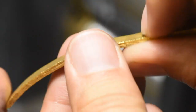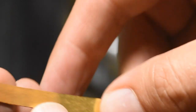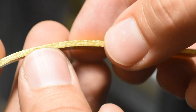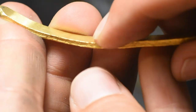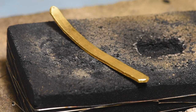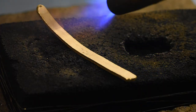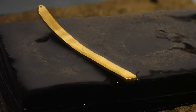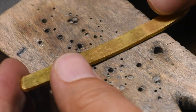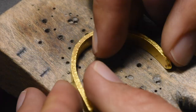You're going to ask how strong is it? Well, after you work harden it, it's pretty strong. But this nice wall thickness is really going to make this ring super strong — it's going to get work hardened. So we're going to have a nice strong men's ring here. Let's get one last anneal before we bend it up into a circle. Sometimes I just like the map gas because it's a little faster. I just love that sound. Look how soft it is. Love it.